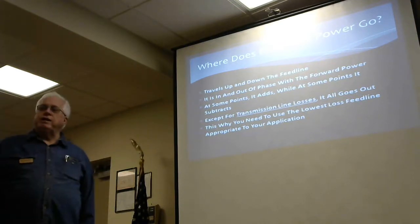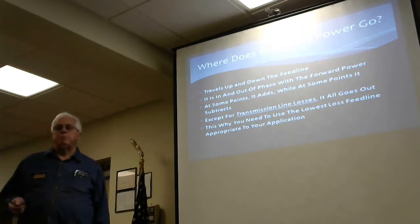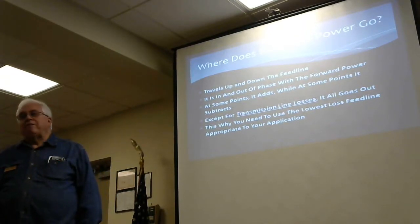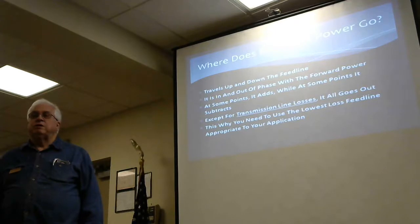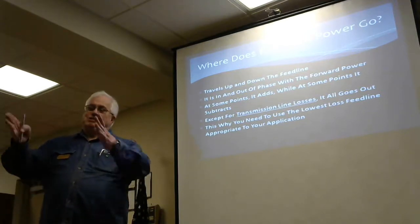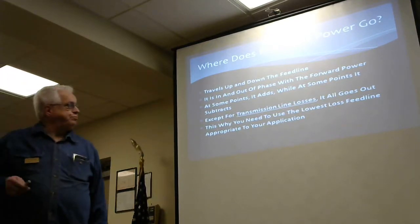Okay, let's go to an antenna, everybody. People are familiar with doublets. We say put up a doublet antenna, which is a dipole, that is at least the half wavelength of the lowest frequency you want to operate. And you feed it with 450 or 600 ohm twin lead. If you talk to Randy out on the other side of the lake, I'm not sure how many watts he's running, but it's a lot. He runs 600 ohm feed line, okay?